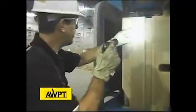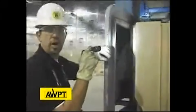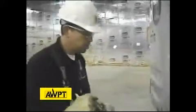We have more electrical cables and wiring assemblies that we need to look at. We want to look at the level of the fuel tank to make sure we have sufficient fuel supply at the beginning of the shift. We want to check our hydraulic oil level with the boom in the stowed position. We're slightly elevated, but we still have adequate hydraulic oil in this particular machine. We'll close the panel shortly.